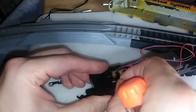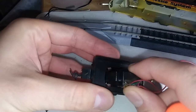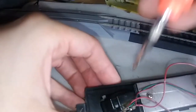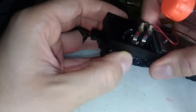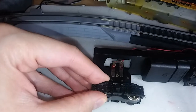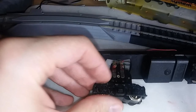I'm not removing the brushes, I'm just removing the motor screw. After I mess with it a little bit, the light went out. I'm hoping the headlight didn't go kaput, but it could have. There it is, now that clip is gone. I see the clip is on the other side — I just have to press this down and it should just drop out. And here's where I got that first clue to the shocking reason why this locomotive wasn't running. I just saw something I don't like.